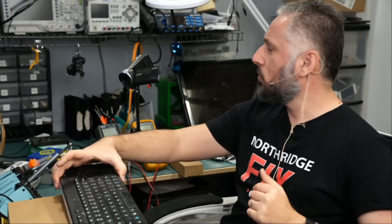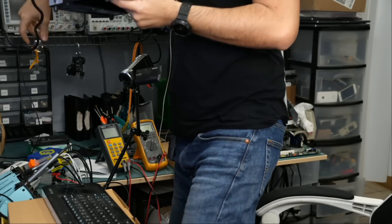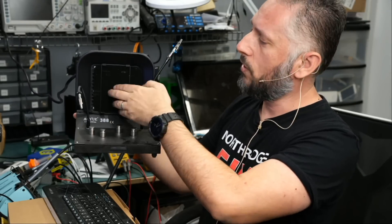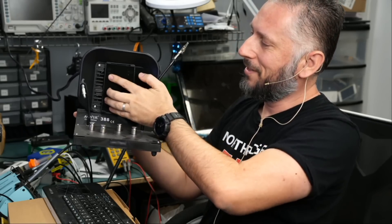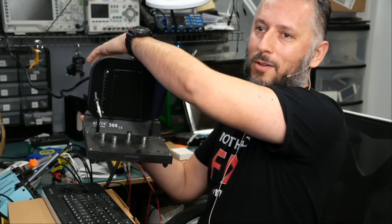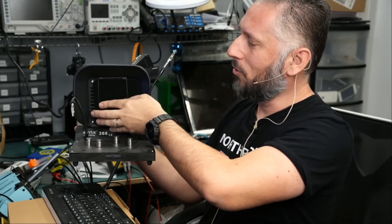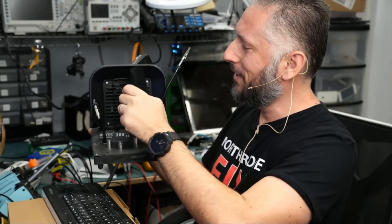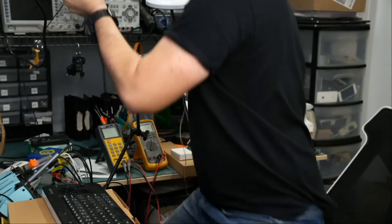We have a three-filtration system here. I'm going to show you a carbon-based fume extractor that was mailed to us by a company that wanted us to carry and sell it — and of course I did not. You have the fan that sucks air in, and in the middle just a carbon filter. The same toxic particles that go in will come right back out. Microscopic particles and big particles pass straight through. Do not waste your time or money buying carbon-based fume extractors.